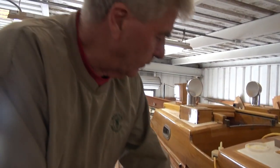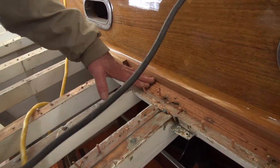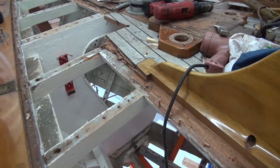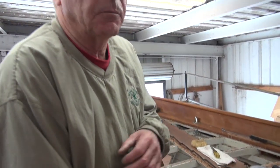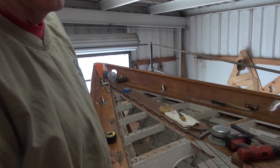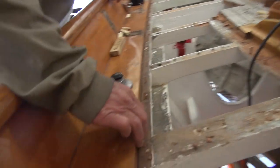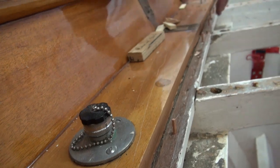The knees went here, and the bolts we covered last time — we've got our cuts made here, a very clean seam all the way around and a good surface for gluing and installing the deck. All good wood in there. How far back did you have to cut? Just barely in some places — almost an eighth of an inch to get a nice fair curve and get rid of any discrepancies in the wood. On the covering boards, the cuts were almost nothing to as much as an eighth of an inch to get a good fair surface.